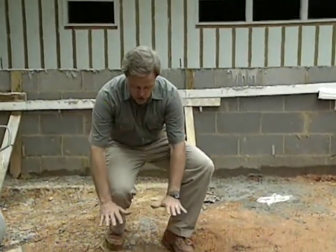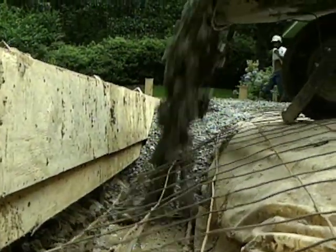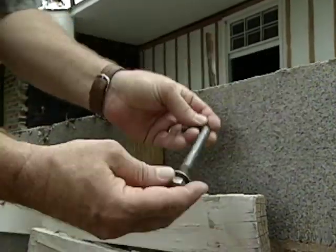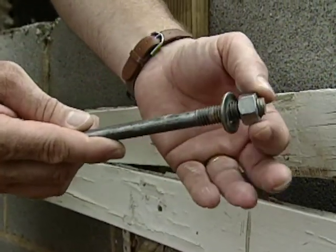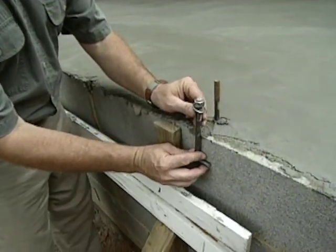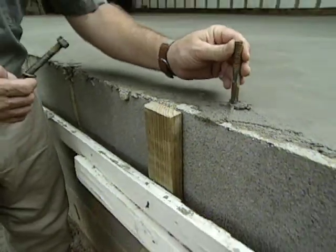A different type of slab involves a situation where you may be closer to the ground — you can go with what's called a monolithic slab. We have a situation behind the house where we're doing that very same type of slab. Because we're close to the ground, we can form it up, dig all of our footings, and once the plastic and wire is in place, it's poured monolithically — the top slab and the footings all being one. Either way — floating slab or monolithic slab — it's very important that the actual walls and wall plates are secured firmly to the slab using anchor bolts. The anchor bolt is a J-bolt with a little turn on the end with a regular nut and washer. Before the concrete sets up, you push it down and position it into the concrete, and once it sets up it'll provide a good anchoring for any of the walls around the perimeter of this addition.